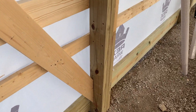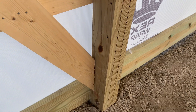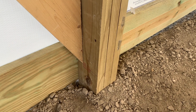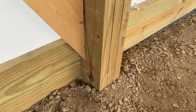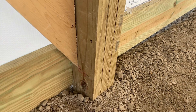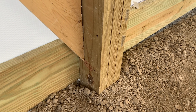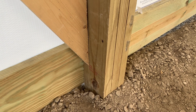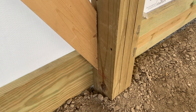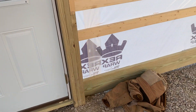On these three-ply laminated columns, due to variance and codes, what we had to do is go 55 inches down. Typically they want three feet, but we went 55 inches. We have a 10-inch footer all through these laminated columns, and we also have two-by-six uplift protections going east, west, and south. Three feet is typically what they want for depth, but on this one we went 55 inches with 10-inch footers.